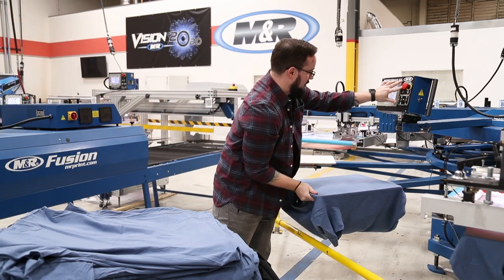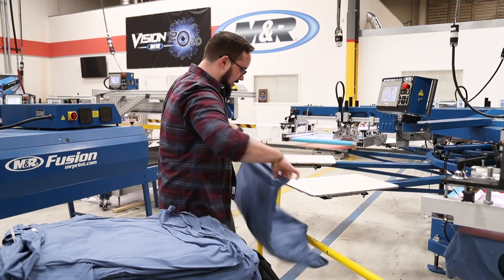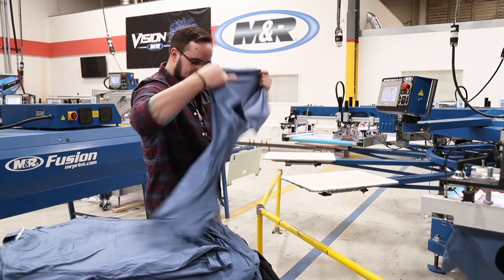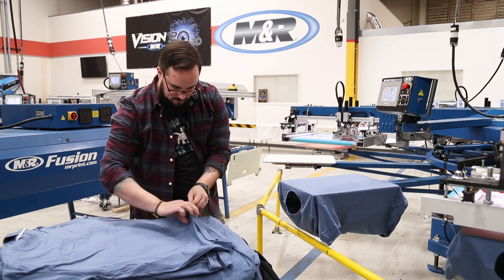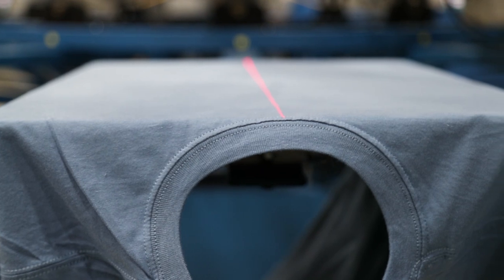I'm going to demo what this should look like when done correctly. This is running at a six and a half second dwell time, which is not super aggressive but is a good standard for what we see in print shops. Load it up, pull it taut, straighten the top out, and we're good to run. Take it, shake it out, find that center, pull it taut, straighten the front. I'm not taking any extra steps — keeping it close to me, not wasting energy. Pull it back, pull it straight, catch the shoulder seams, and there — as you can see, you can get pretty quick with this. It's just a matter of practice.